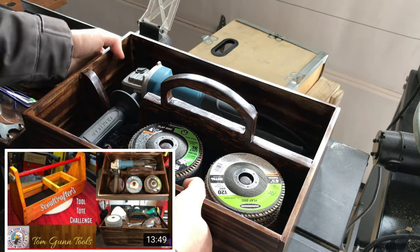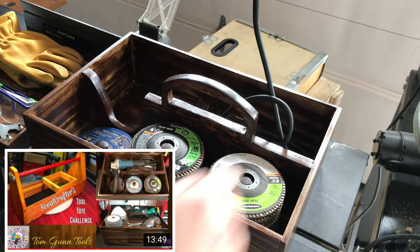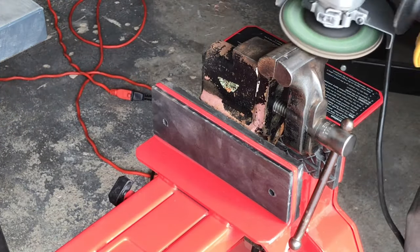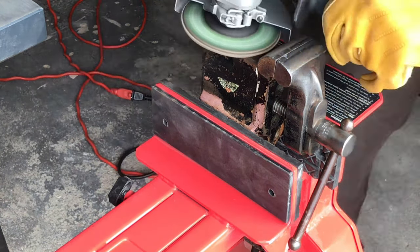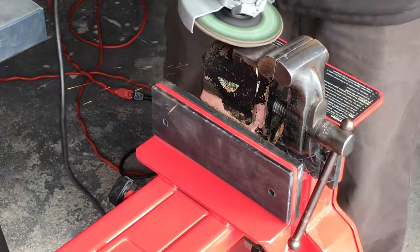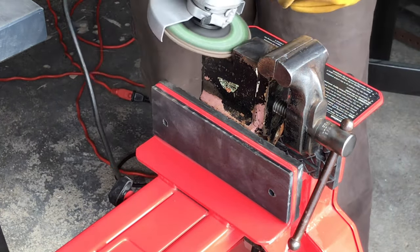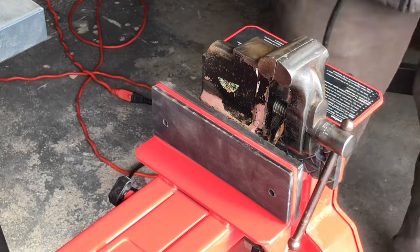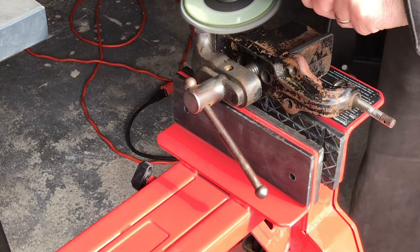Then into the garage. If you guys haven't seen my video on this, I had a lot of fun making this — this is my tool tote from the Scout Crafter Challenge. I made a specific tool tote to hold my angle grinder. I broke out the angle grinder with the flap disc, about 80 grit. And if you look at the jaws, you can see where I did drop that JB Weld in those deep grooves — that helped me from really having to take a lot of material off this vise. What I did is I really wanted to not only take the marks out, but square up the edges where there was some rough castings. Overall, most of the castings were in pretty good shape, and then I'm just squaring up the edges.